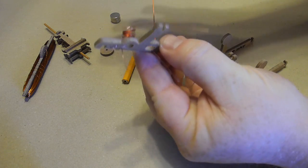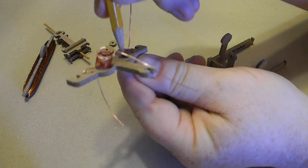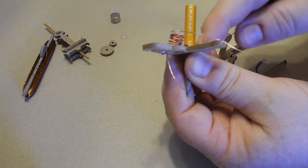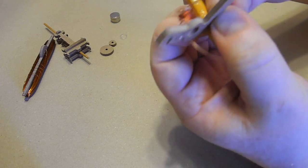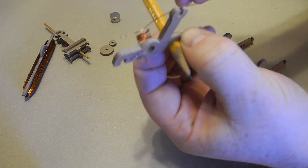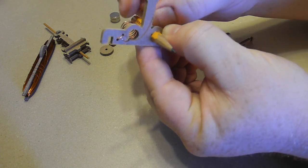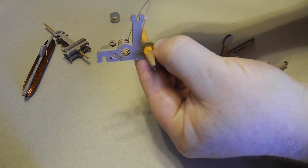Okay, so I've exited next to the hole, as I mentioned. So I'm putting in the pencil, and you wind this the other way. So I'm winding upward towards what will be the shaft of the motor. We're just going to keep winding this, and I'm bunching the wire downward onto the pencil like that until, well, you want enough sticking up to reach, maybe higher than the brush or higher than the motor shaft.